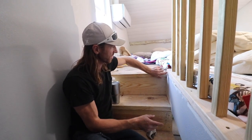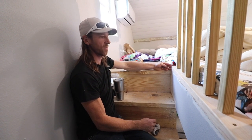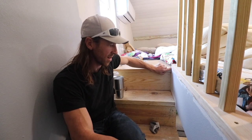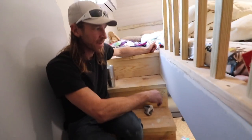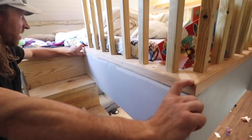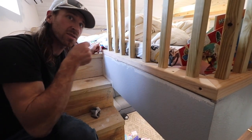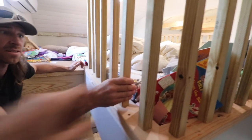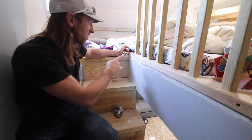It's kind of tricky because you've got to get out far enough to get past the edge of the sheetrock here, right? For your rail to come down. The same thing's going to happen here. So this has all got to be built out for your rail to sit on top of your post. And that's where I think what we might just do is just do slats — vertical — and just kind of bring it down. You can take a 2x4, turn it sideways, and have it run from here to here. And then you really want a second one to connect the slats to. So you have a bottom stringer and then you would need a top stringer. So that will give you something to attach your spindles to coming down the steps.